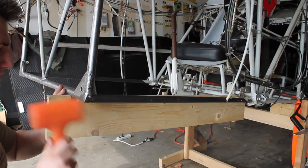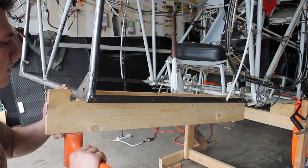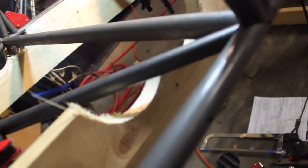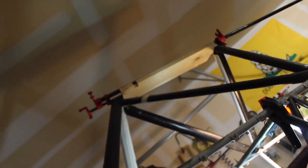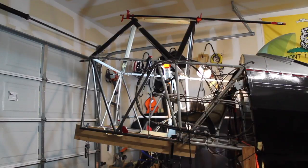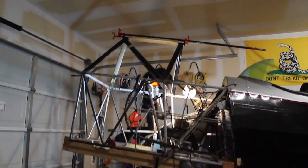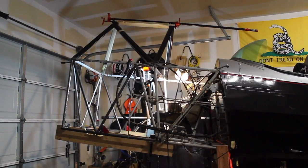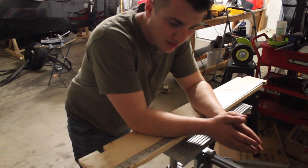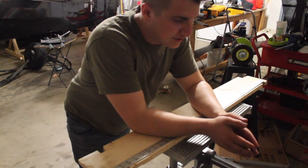Fine tune that, then hold the other side in place. As we're adding tubes here, we're making a little gap so the jig is out of the way of the cross members — we just took a four-inch hole saw to give it plenty of clearance. This jig here is holding the two upper cabane struts. When the top wing is put back on the fuselage, it'll slide right into place with the correct incidence and all that. A couple pieces of wood to hold it in place — jigging can be more complicated, but also that much more important.